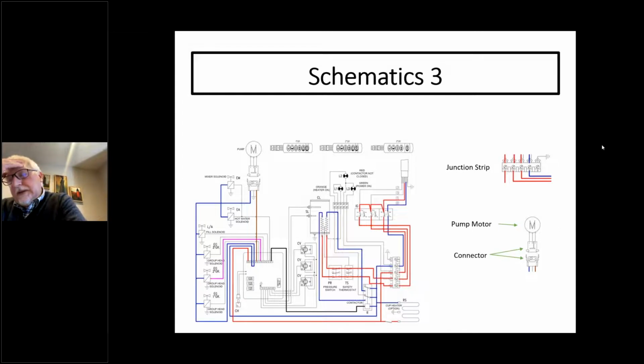I've come across a couple of machines that were originally one voltage and then switched to another, like 110, and they didn't have a 110 in the outlet they were using. So they simply ran that leg directly to ground. It kind of worked, but you can't use a safety feature as a functional part of the machine. It's there as a safety feature for a reason.